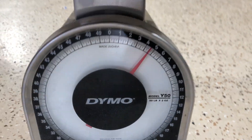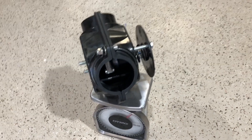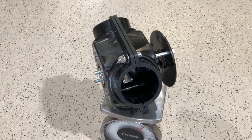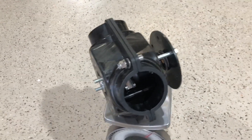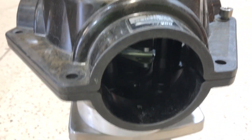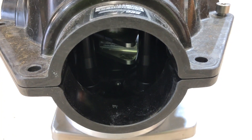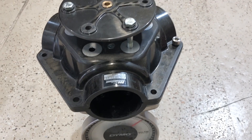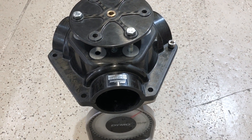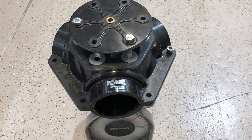We're looking at less than five pounds — four and three quarter pounds — for that hub. Weight is extremely important up front on an airplane, and having reduced rotating mass is also a benefit for the gearbox and the engine. This propeller setup uses a clam shell design, which means the blades can be much smaller in diameter and don't have a large aluminum threaded shank going into the propeller hub. The final product should be close to half the weight of competing products on the market today.